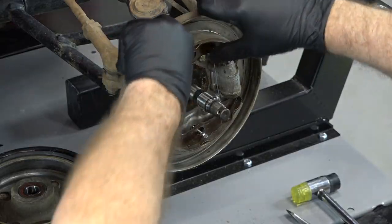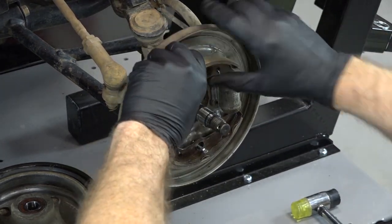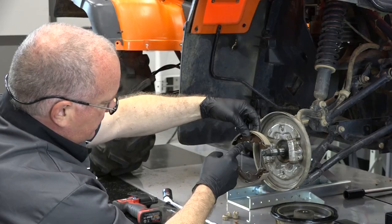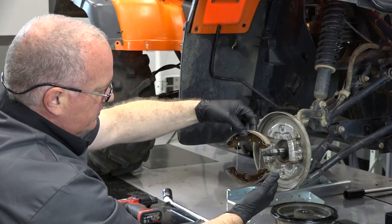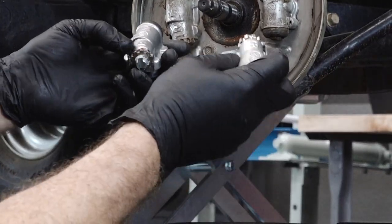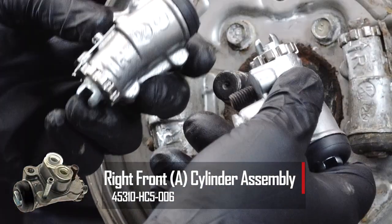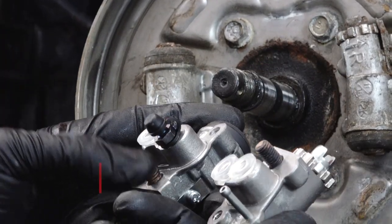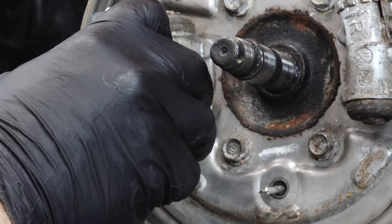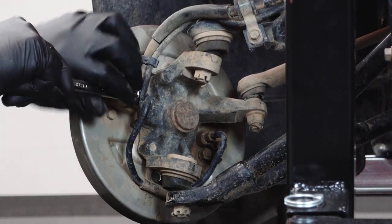Now you can just lift up out of these two little slots and then bring off the springs with the brake shoes themselves. You want to take note of how all this went together because that's exactly the way you want it to go back on. The spring is actually on this side going back, and the other spring is down here going front. There are four different types, but it's a little bit easier because they actually have them stamped right and left. Both of these have an R on them and I'm on the right side of the machine. The biggest difference between these two is this one actually has a bleeder valve on it, and the bleeder valve is the one that goes back here. So let's start disconnecting our hydraulic lines on the back side — just a 12mm.